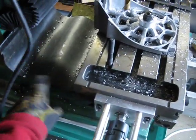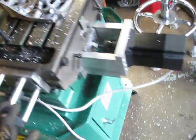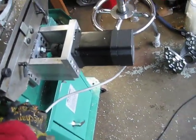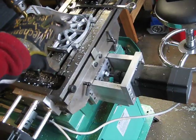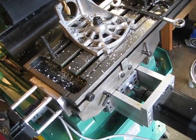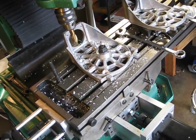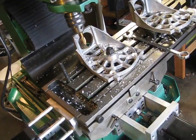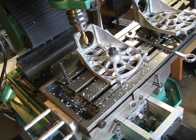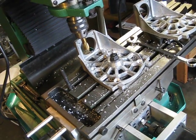That's the overview of the mill. Underneath here, this used to only have 7 inches of motion in this plane, so we cut out a big chunk of the table to open up the path a little bit. Now the mill has just shy of 12 inches of run in the Y direction — that's the limiting axis. It's about 20 by 20 on the ZX plane.